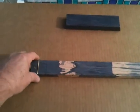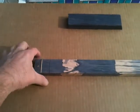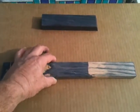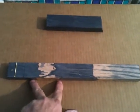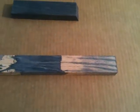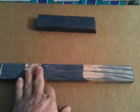I went down to Walmart and grabbed some plain old iron supplements. It's ferrous sulfate, and the bottle of 100 pills cost me about $3 and some change. On this end here, I used 20 tablets crushed up and dissolved in one cup of water. In the center, I tried 20 tablets again in one cup of vinegar — there's virtually no difference, so the acid in the vinegar did not help at all. On this end, the lightest, I used 20 tablets in denatured alcohol.